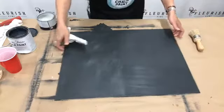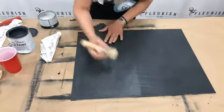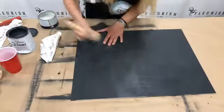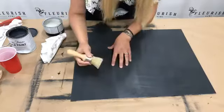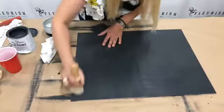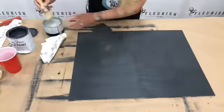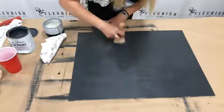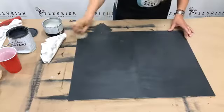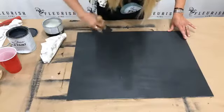You don't really need to worry about over-waxing so much if you're working in a small area and just have a cloth to pull off that excess. I can already see it's starting to shine a little bit. I'm going to do this half that I sanded, and once I let this dry and buff it, you can see which way you would prefer to do it. I can feel the difference — the surface feels much harder and more compressed where I sanded.